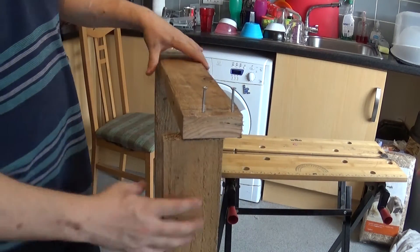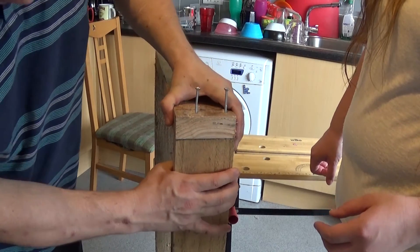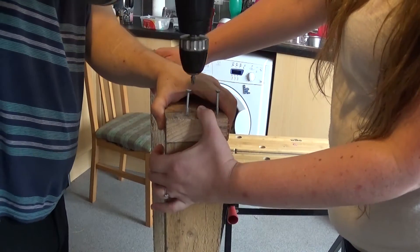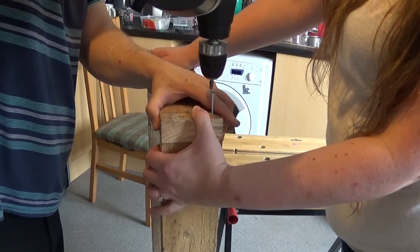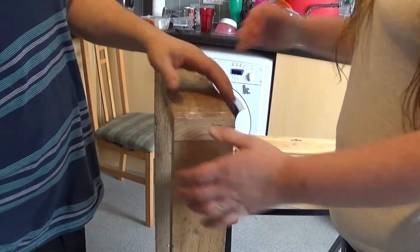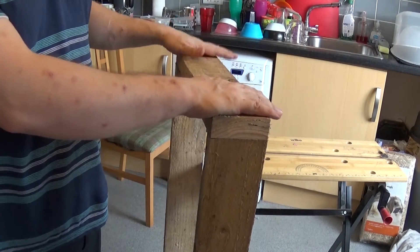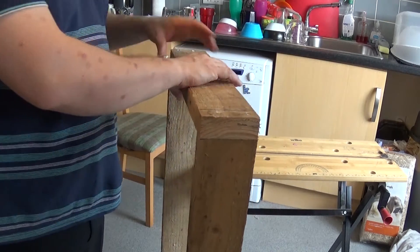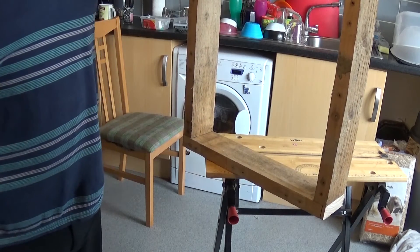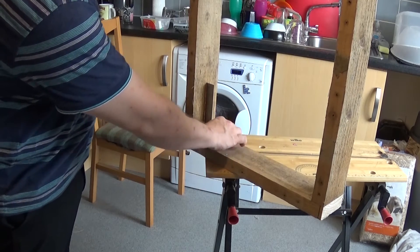It's all wonky, but it's just a case of grabbing it and straightening it up — and that's almost exact. Even if I've made a mistake and it's not square, we've still got room to fix that. Ways to check it's square and level would be with a set square or speed square — and that was looking quite good.